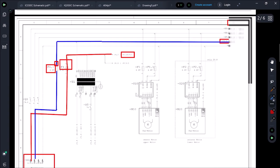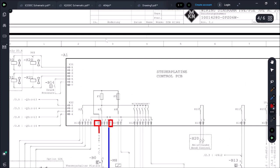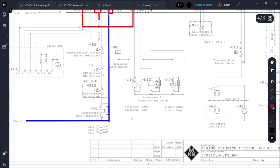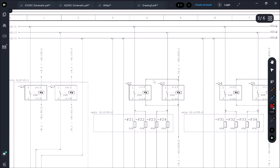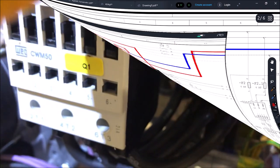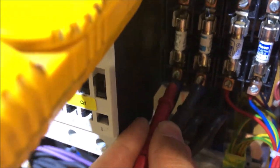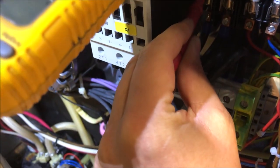Going to page 4, section 3 — and there it is, just like magic. At this point we can start troubleshooting. My first test points are those two fuses. Let's follow the power flow and see where we lose it. Checking power into F4 fuses: 207 volts in, zero volts out — so one or both fuses are blown.